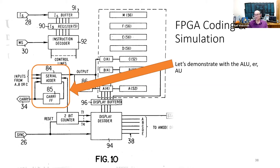The HP-35 employs a 56-bit word size, but the data that's represented in that word are always decimal numbers. So data such as characters or binary values are not allowed. A common technique for working with decimal numbers in a binary computer is to represent each digit using binary coded decimal, or BCD for short. BCD uses 4 bits to represent any digit, 0 to 9. There's room for 14 BCD values in the HP-35's 56-bit word size, so 14-digit decimal arithmetic is theoretically possible.